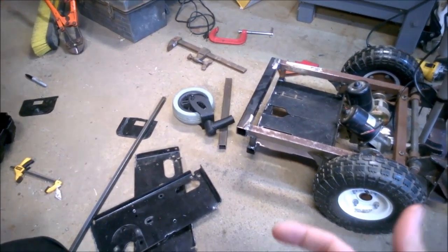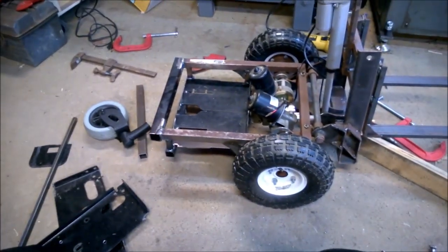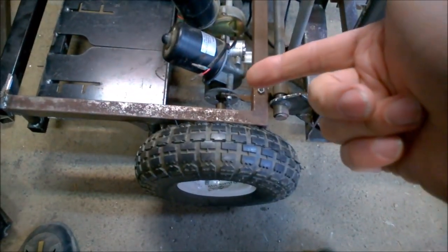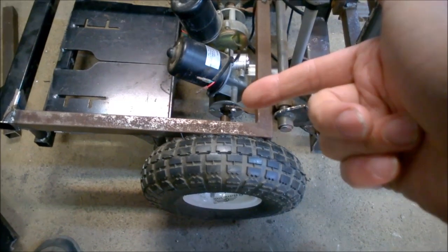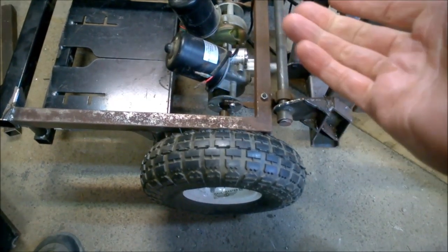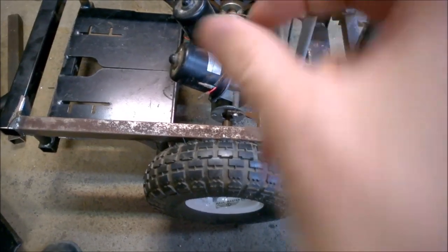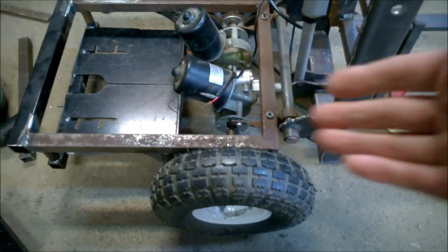We're so close. And also, I chose these maker motors because I wanted an easy to use output shaft that was already with a flat on and everything, instead of the wiper motors that have the taper, where you always get a wobble. Well, these end up having a wobble.